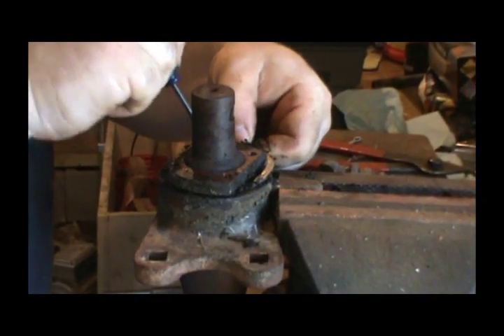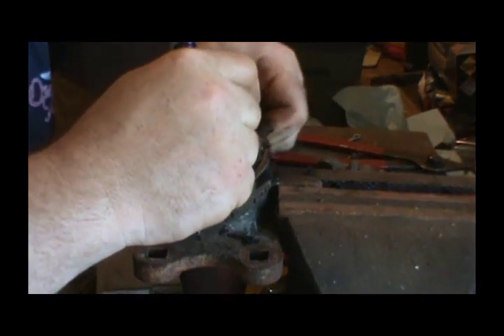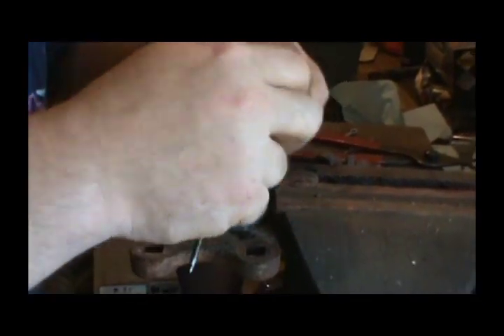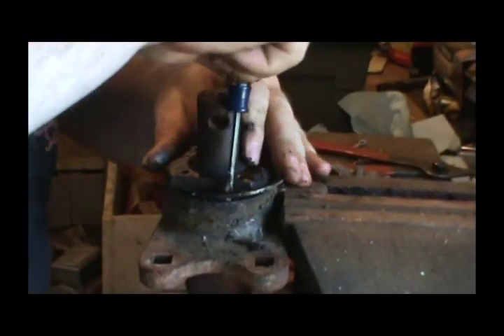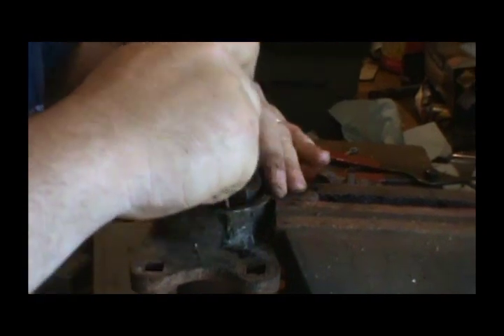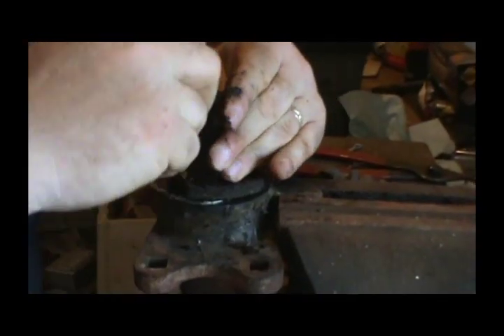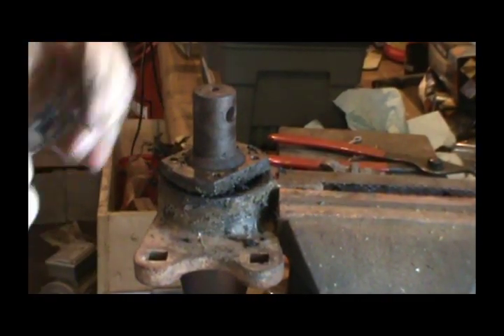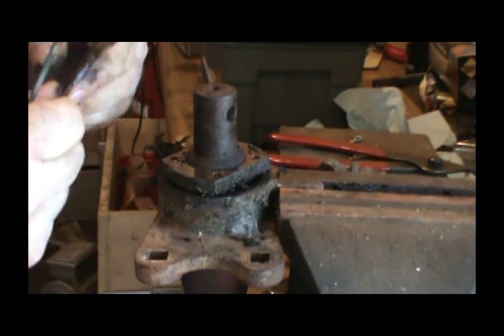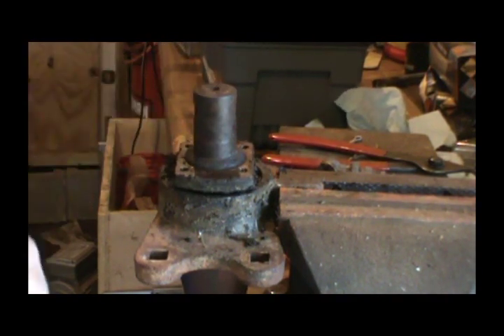Get this over the end of it. Now I've got to put this back down — the rest of it out here. There it is guys. That's the snap ring. If you don't take that out, you'll bust the housing trying to get this bearing out of here.